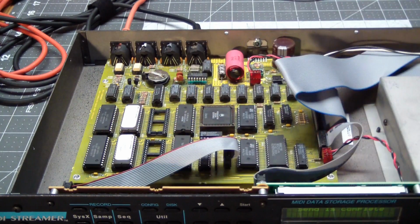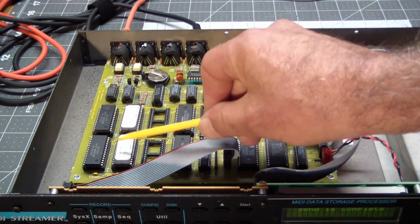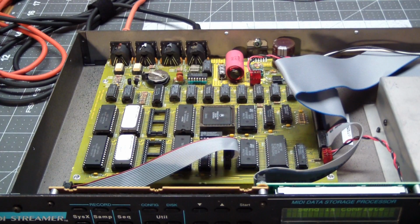On an intermittent EPROM, you will still get random bytes coming out of it, but the patterns will change on subsequent reads, which obviously points to a defect in the EPROM. If that happens, the EPROM's dead, and you have no way of recovering your data.